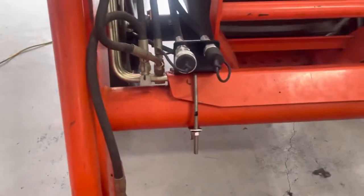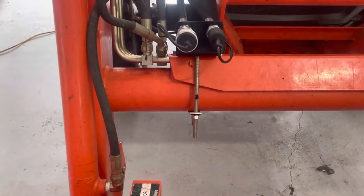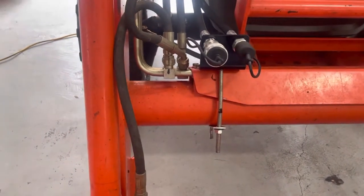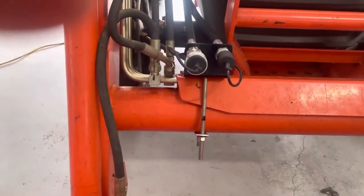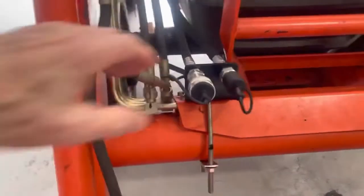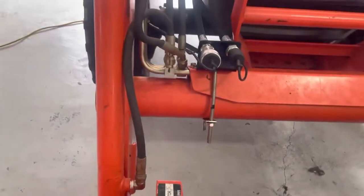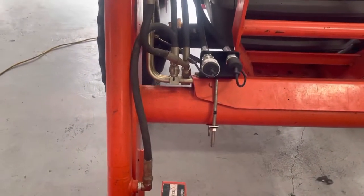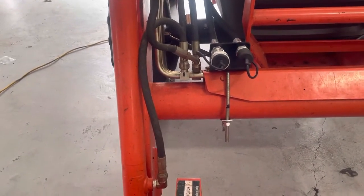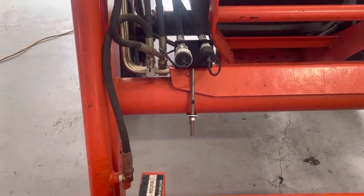In order to get around that, because I didn't have a U-bolt, I used a couple of pieces of threaded rod — 5/16th — and a little piece of metal that had a couple of holes in it. I bolted it on this way, tightened it down good, and it's absolutely, totally solid. It's not going anywhere. Those were 8-inch threaded rods that I used there. I'm going to cut them off and paint them Kubota orange to make them look a little better.